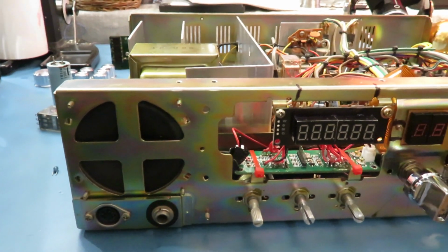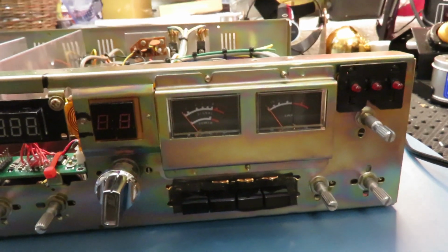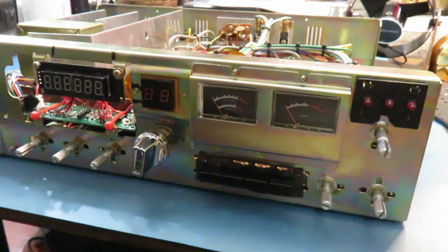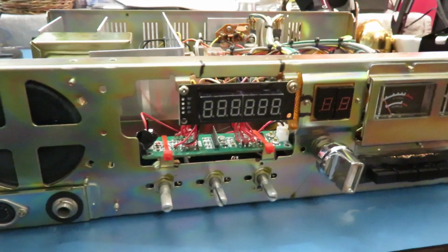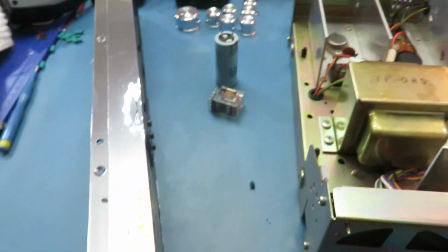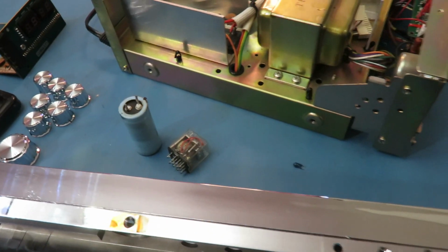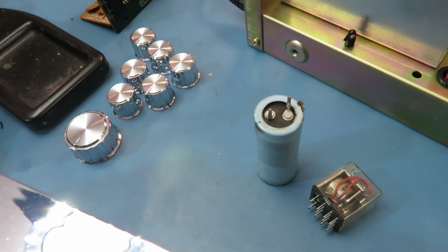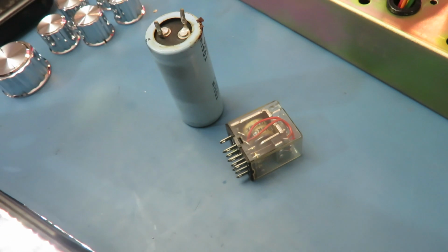Alright, here's another part of this TRC 457 sideband base station that I'm restoring on the bench of BCool Radios. What do you think? I'll go over some of the upgrades and work that's getting performed. As you can see here, I take this guy all the way down to the sheet metal and remove everything. Polish up those knobs, remove the weak components, take out that relay, make sure the contacts are polished, and even upgrade that pesky C179.